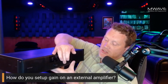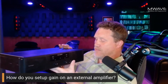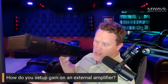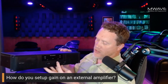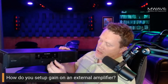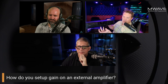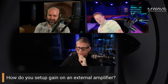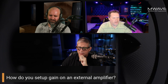For a fixed amp — like a traditional audiophile amp — they might have a 29x or 32x gain structure. You can figure out the gain structure on this unit by counting all the indents and multiplying by two dB per click — that tells you the total gain structure.